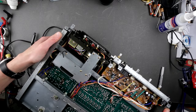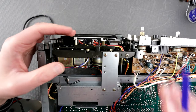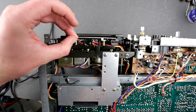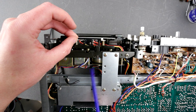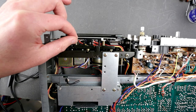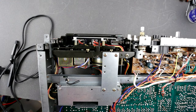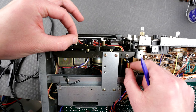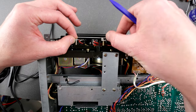Here is our tape mechanism of interest. The tape gantry is actually moving pretty freely — a little too wobbly, I would say. There's a little screw I can tweak. It's wibbly-wobbly and that has to be addressed somehow. When it's fully in position it might be fine, but there's no friction from the solenoid — it's just moving super easy up and down. That's definitely concerning. This also gives me a chance to look at the pinch roller.